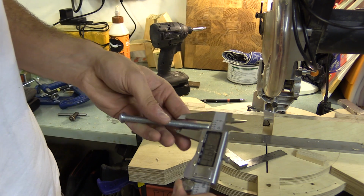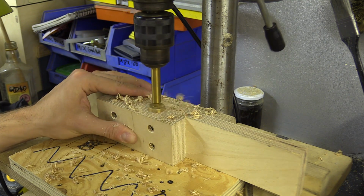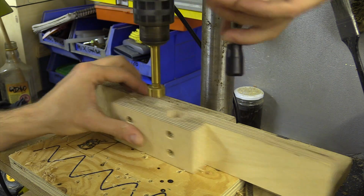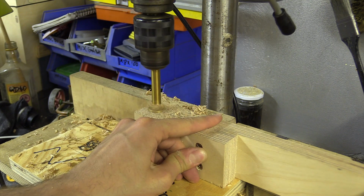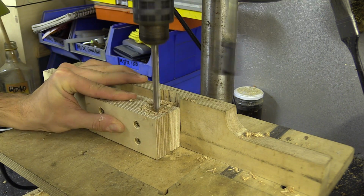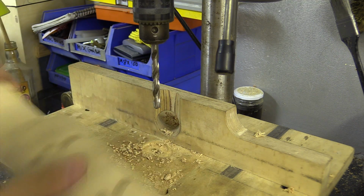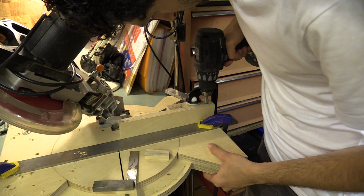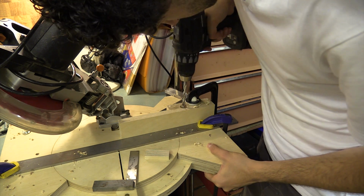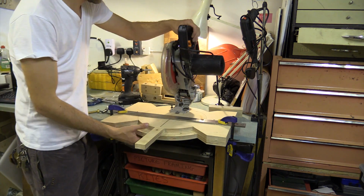I worked my way up to 8mm, which is the diameter of the fixings I will use. I also used a Forstner bit to countersink the heads of the machine screws. I made sure to clamp the fence down before drilling the final holes and used pronged wood inserts at the bottom of the base to secure to.